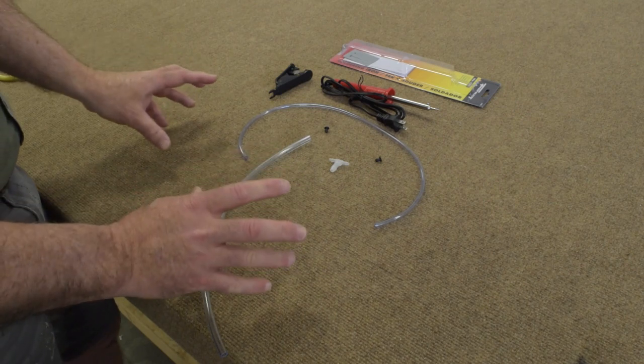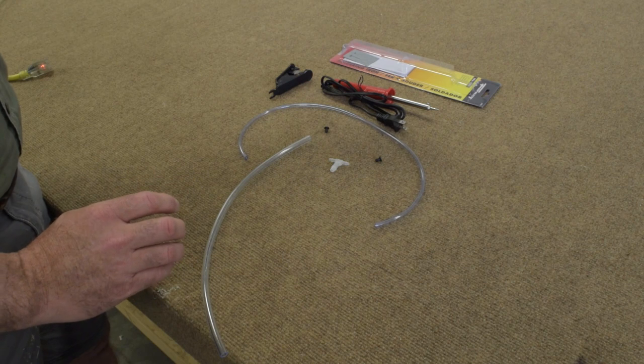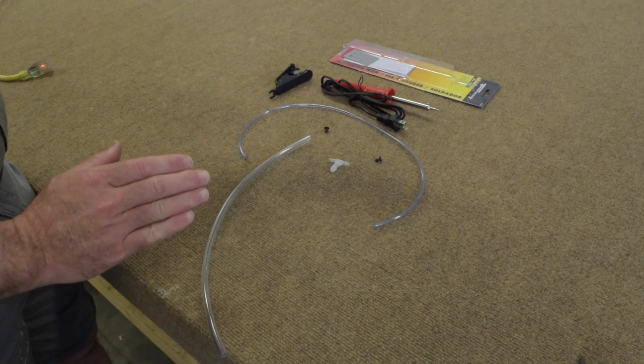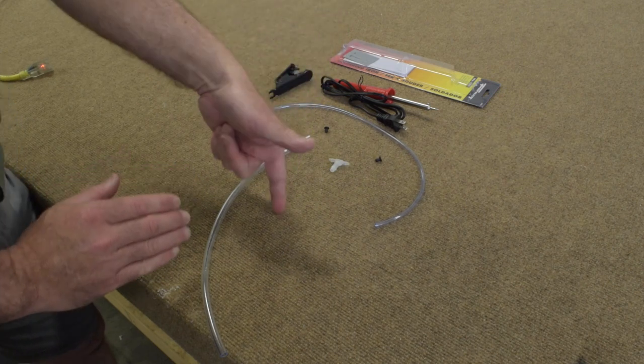So when you set up your rocks in a drip wall, typically you want your thinnest rocks at the top with your medium rocks in the middle and your big, thicker rocks at the bottom. And you want their faces to come out at an angle so that they fall out onto the next one and fall onto the next one.